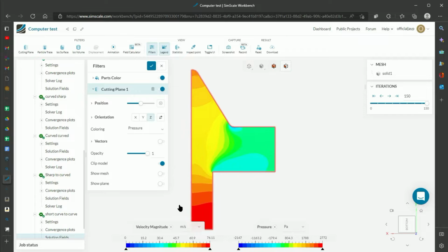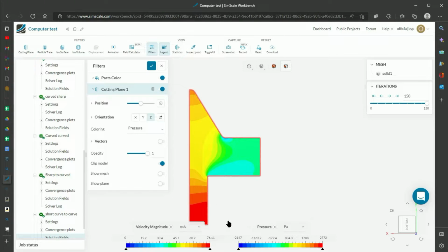And so as you can see on this basic one, you have a high pressure spot in the bottom and another high pressure spot at the top. That makes sense. This is where the air is really constrained as it's pushed by the fans up against this face. Can't go down, can't go forward, all of it has to go up. So there's a super high pressure section right there, the same to a lesser degree up at the top there. And then it heads into lower pressures as it reaches here. As it isn't constricted up against those faces, it can just flow straight through the section, straight out this outlet here.